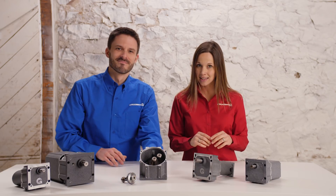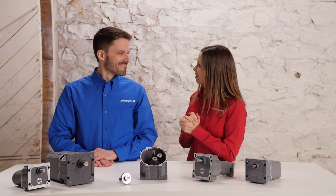As we stated in the last video, we won't be discussing positioning applications such as robotics, which require zero backlash. Let's get started with parallel shaft gearboxes. Parallel shaft gearboxes work well for continuous applications using low torque, applications with higher ambient temperatures, or where cost is a concern. They are used in a variety of industries from industrial to medical applications.